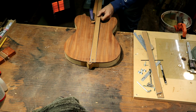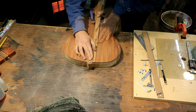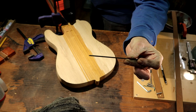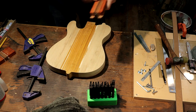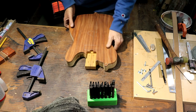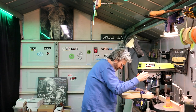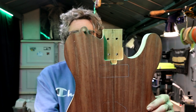We get this lined up with the center line on our fretboard, then come down to this end. We've got this little center punch pin right here — I don't want to hit it too hard because I don't want to move it. There are my holes for my threaded metal inserts. Now we're going to drill these out to 7 millimeters — straight on through. Four holes. We're good.